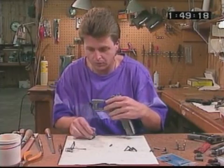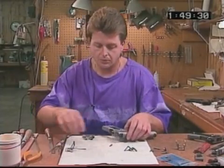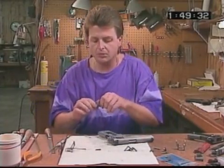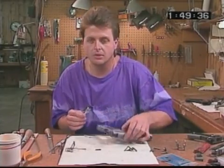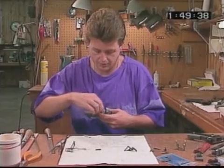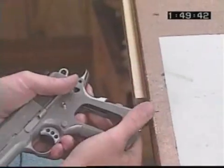It was running more towards the top. It's a little narrower up here, and it's wider down here, so you're getting your contact on the leg at the top. Now, would you file it down a little bit more at the top then? Well, you really want to keep it just flat, but you might have to concentrate more on whichever side is hitting the worst.